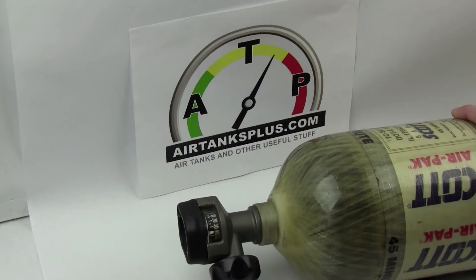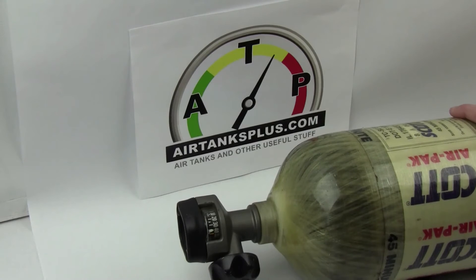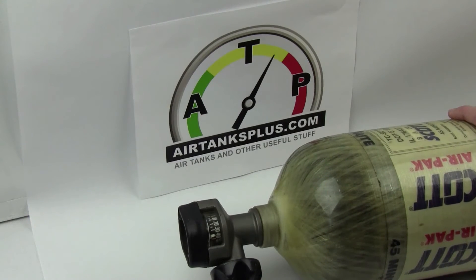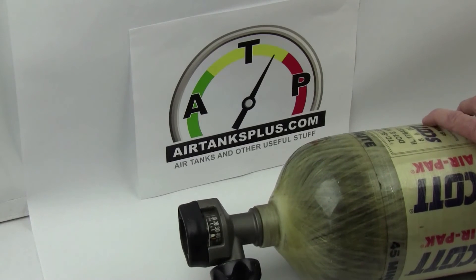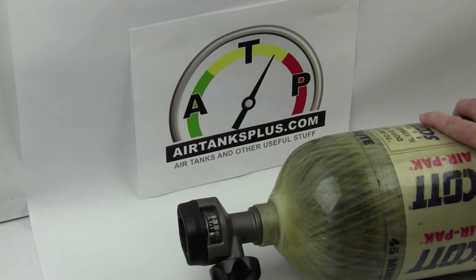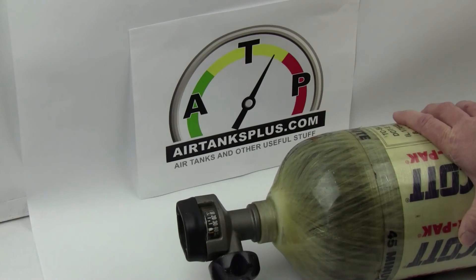If you bring a tank in empty it causes problems. Typically if they see an empty tank, the next thing they're going to look for is a fresh hydro sticker — where obviously you drain the tank, send it in for hydro, and you have a brand new current hydro sticker good for another five years. That would be a pretty good reason for a tank to be empty. Another reason might be if it had an o-ring that leaked. They're going to ask you why the tank is empty. When they see pressure above 1,500 psi it lets them feel more comfortable about filling it, because when you fill high-pressure air you can get something called dieseling if there's any foreign matter in the tank. Having a tank that already has air in it kind of relieves their fear of that type of problem.